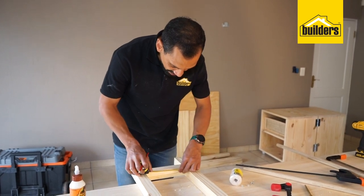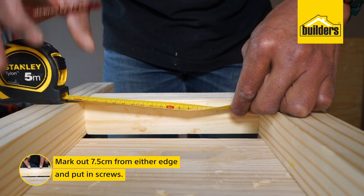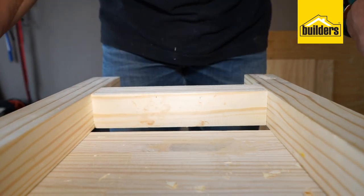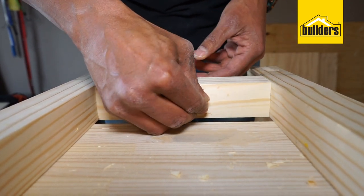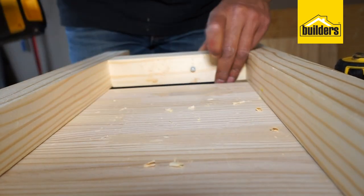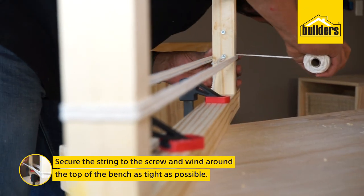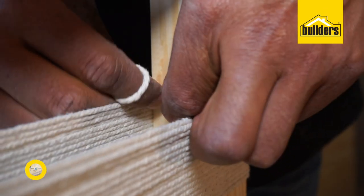Now we're going to put the twine over the top part of our bench. I'm marking out seven and a half centimeters from the inside edge and 12 and a half centimeters — so that's seven and a half from either side with a five centimeter gap in the middle, and that's where we're going to put our cotton string. To start the process, put a screw in at the mark to give us a place to bind the string to, then put another screw in at the other side. Wind your string around the top of the bench as tight as possible and seal off with a knot — this gives the seat extra support for when we put the rope in place.